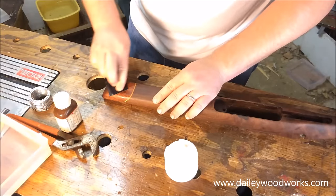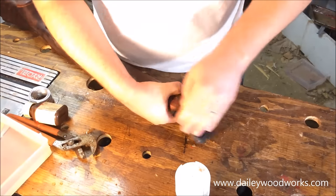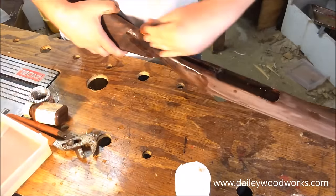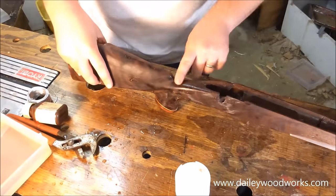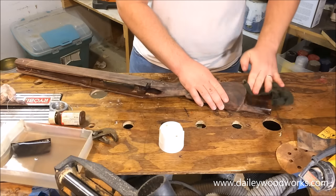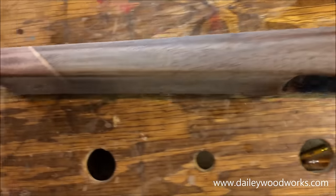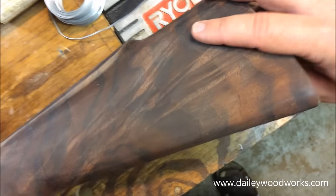At this point we've done two coats of the diluted True Oil blend and everything's sanded to 220 grit. Now it is time to start wet sanding with 320. I've let the finish set up about 12 hours — it's a little bit harder, but wet sanding will still continue the process of sawdust mixing with the not fully cured finish, filling those pores even more. The 320 will start leveling out that finish. I'm now taking a damp cloth to wipe down all the dust. What needs to stay will stay in the pores and what wants to come off will come off. This is one of those things where it looks worse before it looks better.